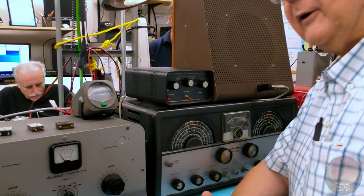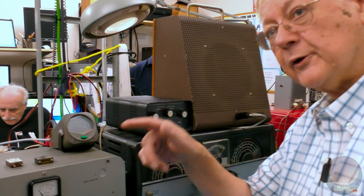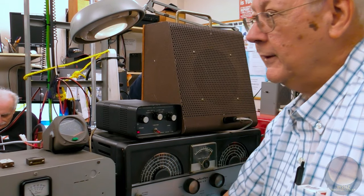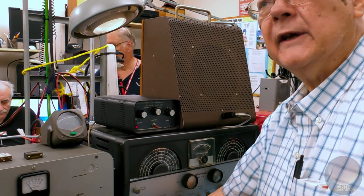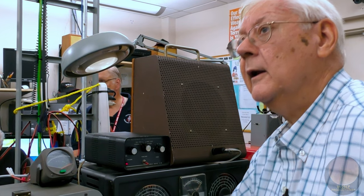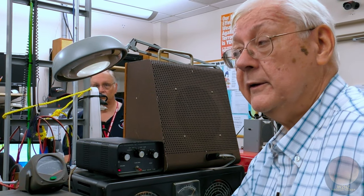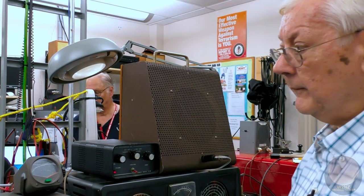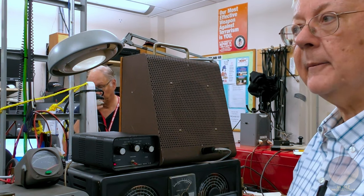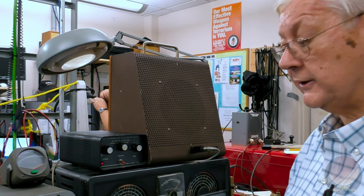If you were operating phone, especially on a band like 10 meters, which would multiply to twice, get almost up to the channel 2 frequency. Channel 2 started at 56, I think, Glenn, right? Yep. 56 to 60 or so? 6 meters was the real devil. You're even closer. But 10 meters or 6 meters, either by doubling or just by overload from the 6-meter transmitter.